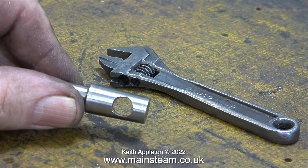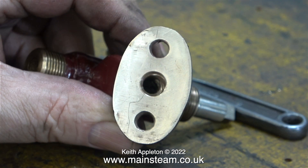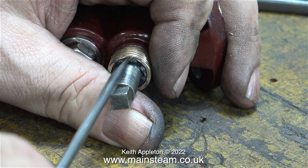How did I correct that? Very clumsily to start with, by using a file. I made the hole a lot larger and moved it in the right direction. I didn't leave it like this though — once I'd removed the bulk of the material, I put it in the milling machine and used a milling cutter to clean it up. And if only I'd pressed the record button, I'd be able to show that operation, but alas I forgot to do that. If you look carefully at this clip, you can still see there's a bit of a smoothed-out step in the casting, but the step between the casting and the centre rotary part of the valve has now disappeared.